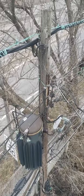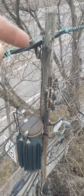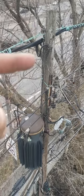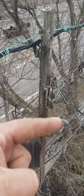We've got a bundled three-phase that comes across here, we've got a ground wire attached to this messenger cable that heads down the pole, we've got this single phase that comes down past the secondary, loops underneath it, catches the top of this cutout which is bare.